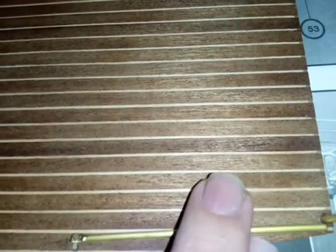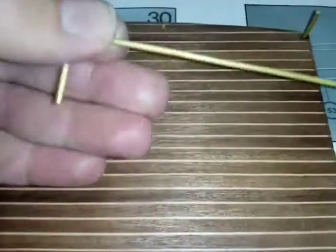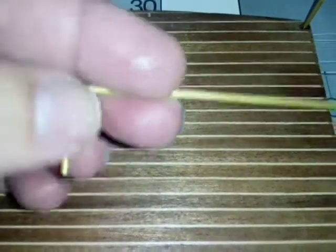When you've made two 55s, line up and get your hole by butting that on the upright — that'll give you your position for your holder. Drill through there, but remember it's only two millimeters into the wood and 2.1mm into the brass.